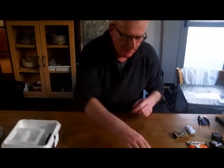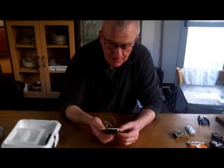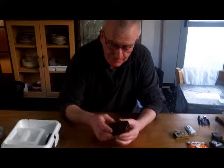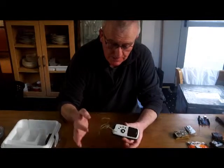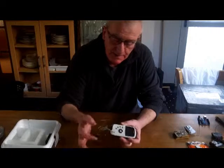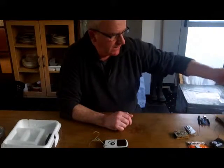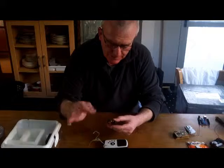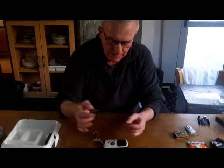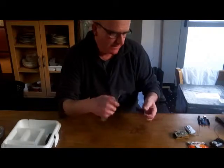There are other cameras available. Another one I've used in the past is the Kodak PlaySport — this is one here, and I'm actually shooting this video on a PlaySport as well. I've found them to be quite reliable. What I've done is hacked it somewhat — I've taken the battery pack out and soldered some wires onto the battery terminals inside the camera. I've then soldered wires to two sets of battery terminals and linked them together, so I'm using two batteries instead of one, which gives you longer recording time. Again, it's personal preference what you use.